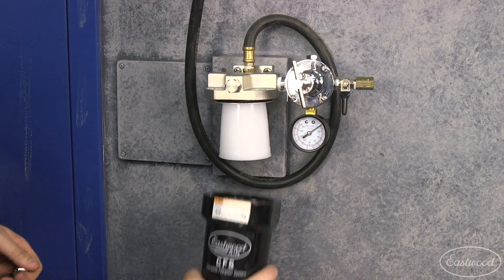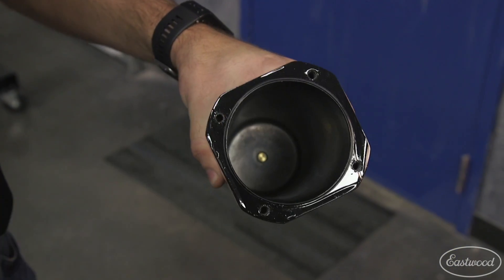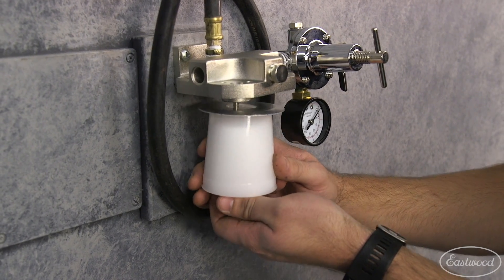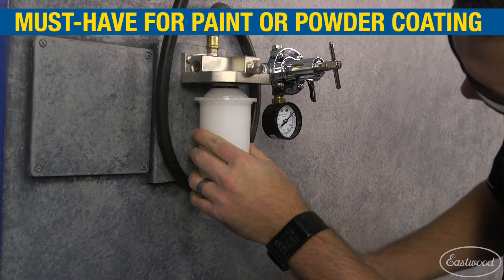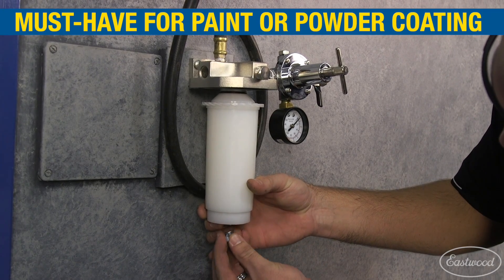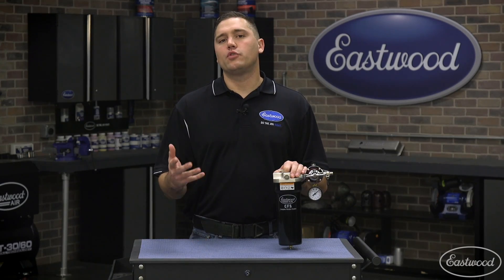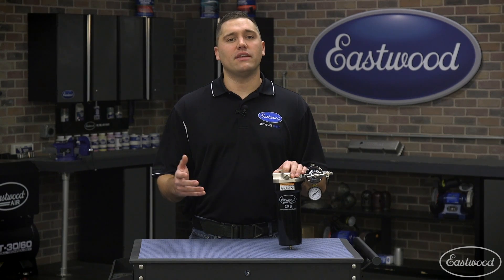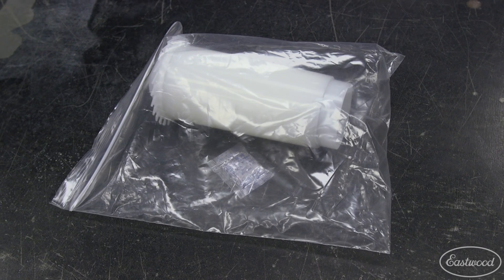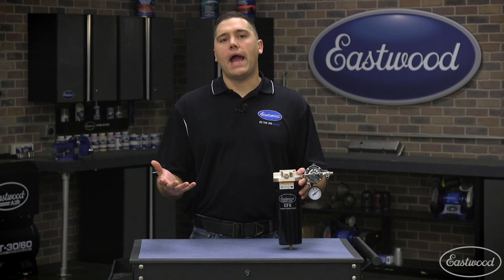First, drop the canister from the housing. At this point we recommend drying any residual moisture inside the bowl. Now remove the wing nut and pop these pieces off — these will be saved for later usage. The new parts are now ready to be installed to hold the desiccant securely in place. We recommend saving all the old parts for later, since generally we only want to use a desiccant during painting or powder coating jobs — you'll be able to switch back and forth as needed. To allow the desiccant to last as long as possible, I personally put mine back into a zip-lock bag when not in use, along with some small desiccant packs, which you usually get from items such as a bag of beef jerky.